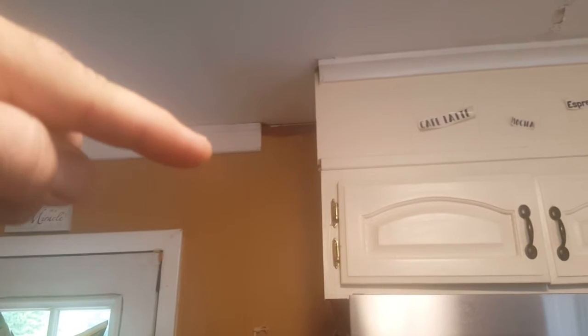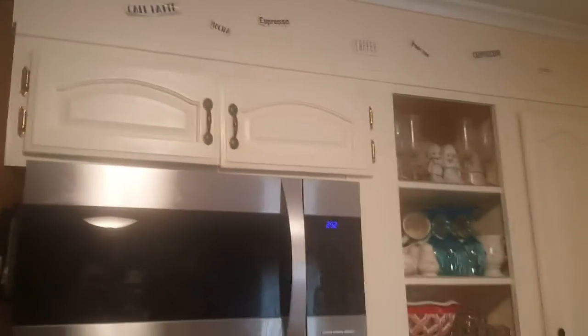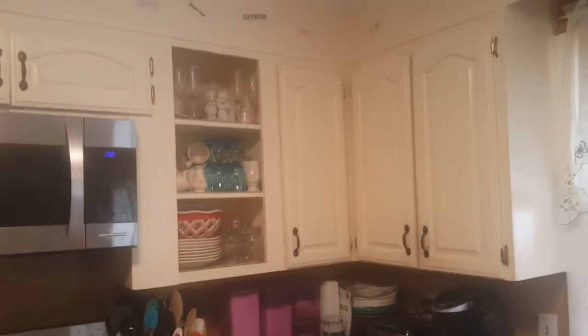room for moldings. Now the original molding that's here, if you look, this is a case molding that's 4¼ inches tall. This is another cove molding that's about 1 7/8, 2 inches tall, about 2¼ on the face. So if we use either one of those type of moldings around the room, we'll have to have at least 3 inches of space above the cabinets. If you hang a 39-inch upper cabinet, you're only going to have about 2 inches of space above it. So we must go to a 36-inch upper, a top alignment of 90 inches.